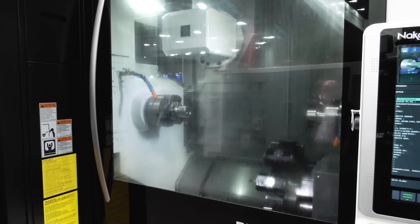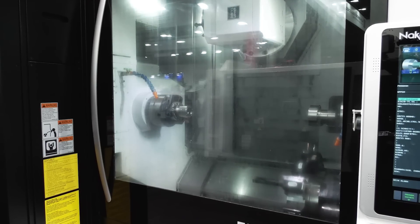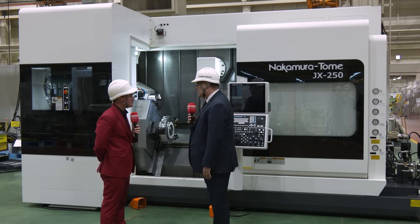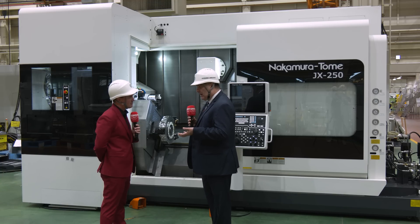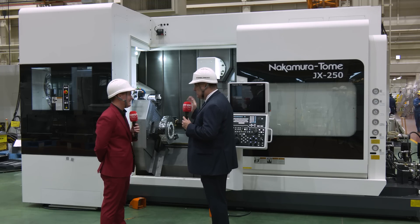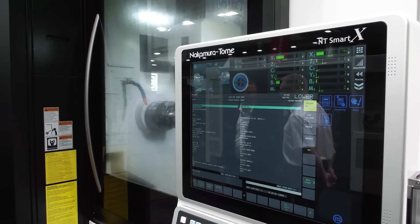With the smart cube, we are truly able to rotate this piece of art and still maintain the cutting process because of its overall compact size. And I'm not losing rigidity, torque, or horsepower. Absolutely not — there's a lot of new servo technology that comes with this. Even though you look at the size of that spindle, it's still a 25-horsepower spindle on this machine. The motors are smaller but more powerful. The unique thing about this machine is also the mass behind that spindle — this machine weighs 55,000 pounds. Very heavy-duty construction, very stable, and it's not only the rigidity of the spindle itself but the rigidity of the overall machine.